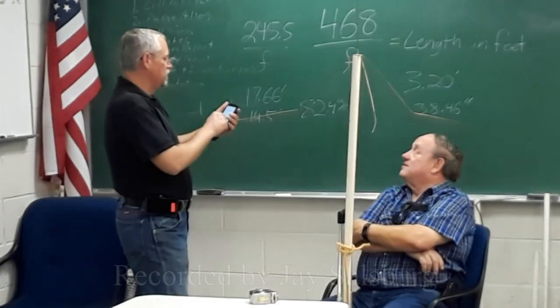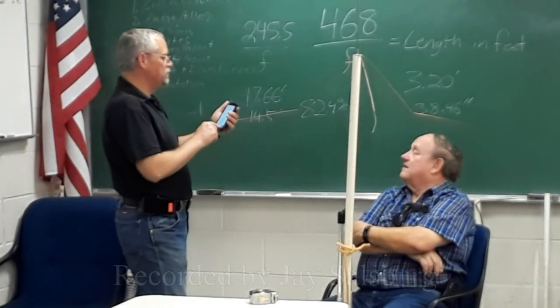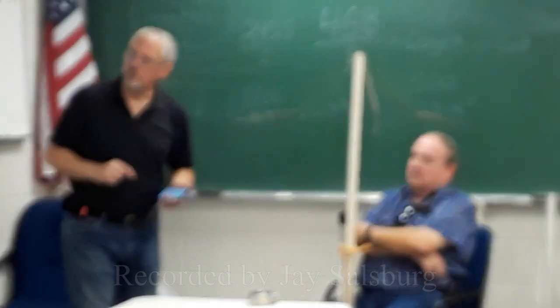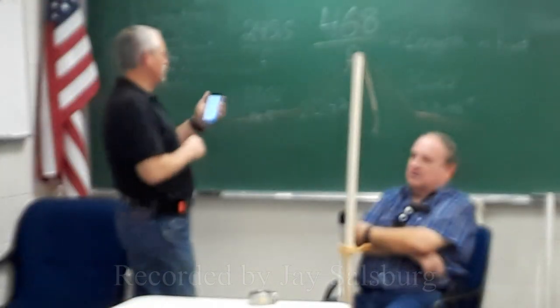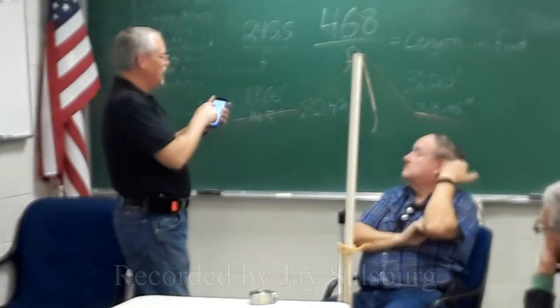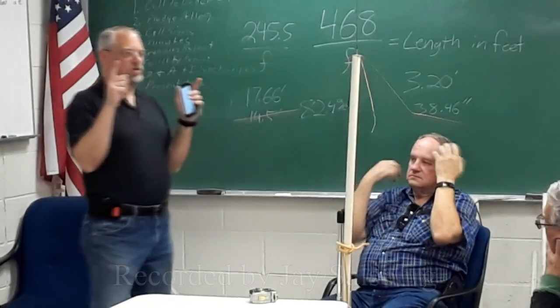245.5 divided by 146 megahertz equals... or was that a resonant frequency? I don't remember. We'll just go with 146. Yeah. So that's 1.68 feet, which is a quarter wavelength.